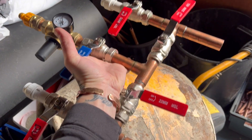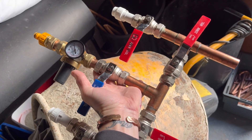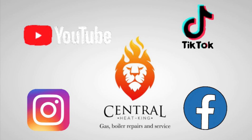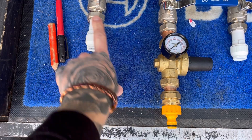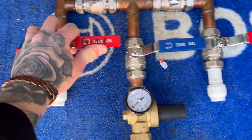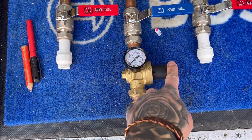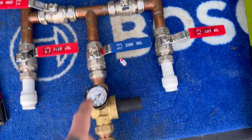Today we're finally testing out this little mains flushing unit with a reversible function. A little bit of amendments I've had to make — I've made these two 22mm to 15mm speed fit reducers, just for the dump hoses. That's basically the only amendment. Mains water is going to come in here into a pressure reducing valve, because some properties will be over three bar and I don't really want it running over three bar, with an isolation valve for that.